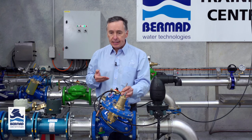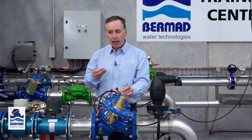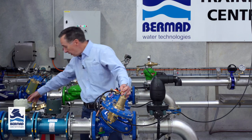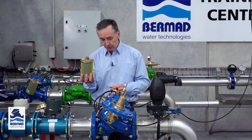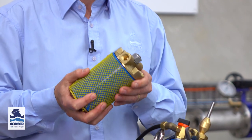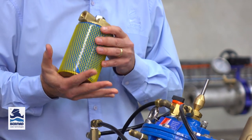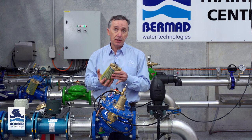Finally, if you're working with water that may be treated effluent or the water quality is very poor, or if your valve is in a very remote location and you want to minimize maintenance, one of the things you can do is fit our large oversized LC filter instead of our standard filter. This will give you a lot more security and reduce the interval between servicing of the actual valve itself. It's unusual that you're going to need this, but if the water quality was dubious or the valve was in a very remote location it may be something worth considering.